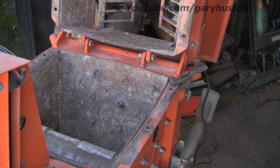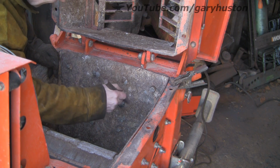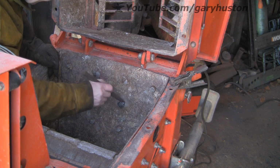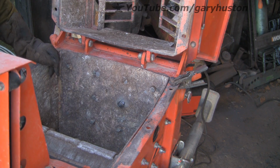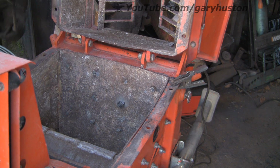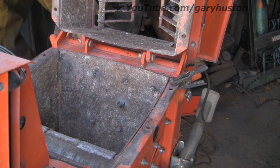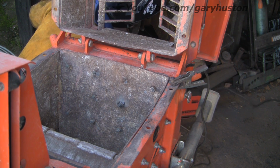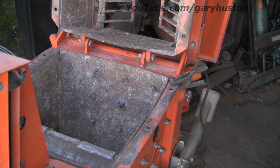I sold a lot of packets of these rods years ago, and the amount of people that said, "Oh, I can't run them, there's something wrong with them." Well, no, I'm sorry, I did say in the advert you need at least 80 volts, and I think a lot of these people thought I meant amps, but no, I meant volts. Anyway, this little set will run them all day once you can get them started.